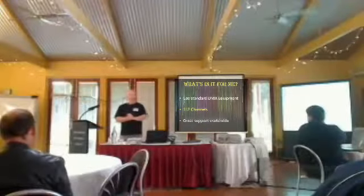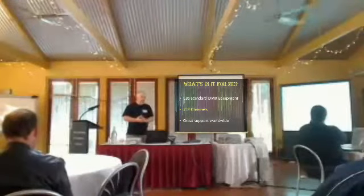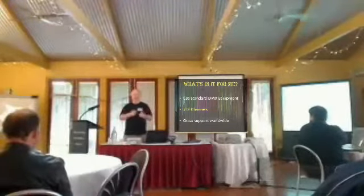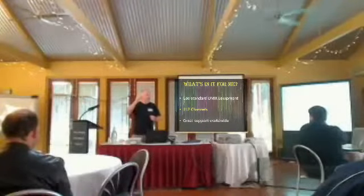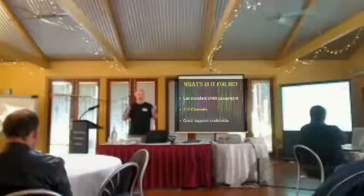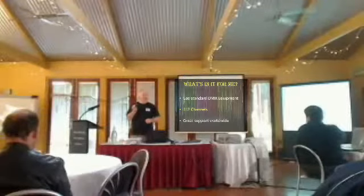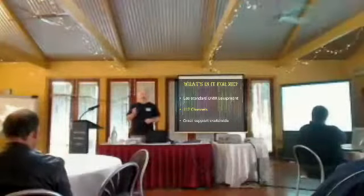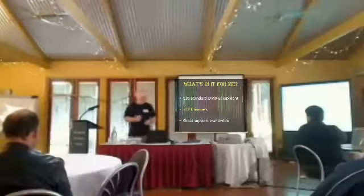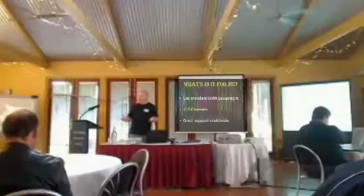You will hear mention of Hyper DMX. Hyper DMX was a little project put together by myself and Ed, who does the J1Sys range, to say we want to get more than 512 channels out on that piece of copper. We want to get up to 2,000 channels out on that piece of copper. So we came up with a way to get four times the data rate. Coming out of one of these, off your Cat5 cable coming into the controller, comes out at 250 kilobits per second. All we did was send it out at 1 megabit per second. We didn't do anything special. We just took four times the data rate, but the controllers are cheap. The dongle and the controller are there for Hyper DMX. So there is nothing magical about Hyper DMX except it's a faster data rate.